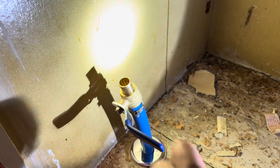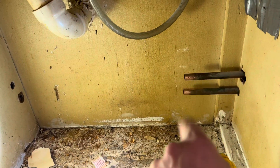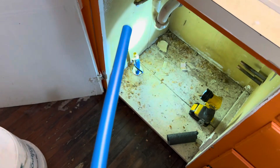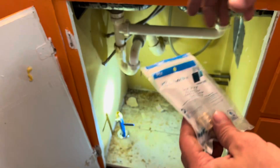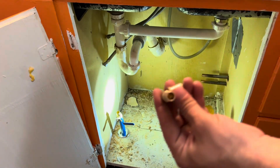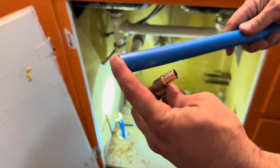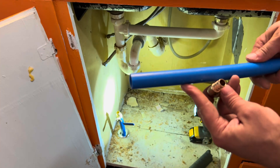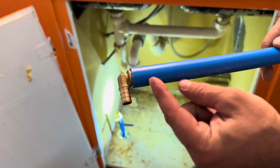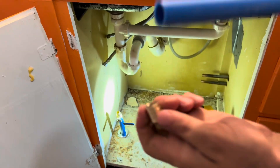There's nothing here so we have to connect the pipe. I'm going to use the elbow going this way and connect to this top copper piece right here. I'm going to take this piece of pipe and cut a small piece off. I'm taking a short piece of three-quarter inch because this is a three-quarter inch ball valve. We want a piece that is long enough to fit this portion and the piece down there, so we'll need a little bit longer than what's here.